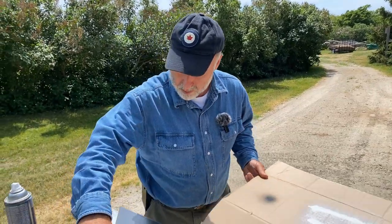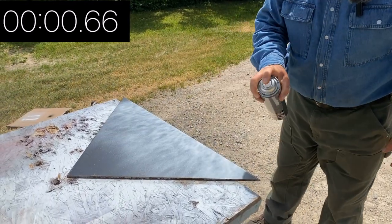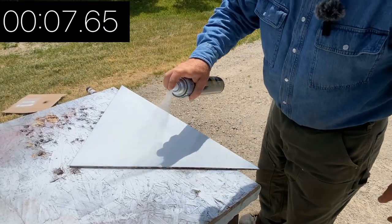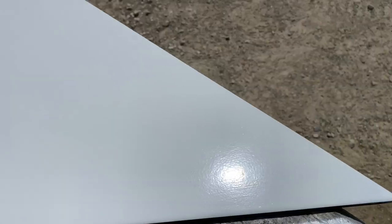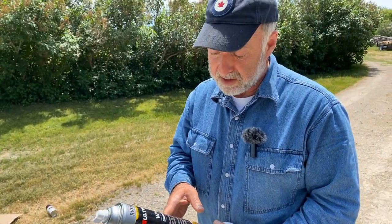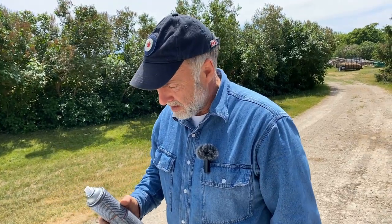We can make some room here and get some paint on this steel. It's nice and even — there's a lot less chance of marks caused by going back and forth with a small spray stream. This would cover a very large area. I've had excellent results with Rust-Oleum paint in terms of rust resistance — it is the best exterior rust paint I've ever seen. I've tried lots of different brands. This is an enamel, an alkyd, heavy duty, and it certainly goes on fast as you can see.